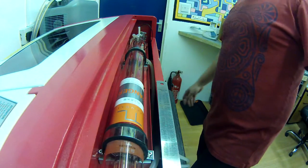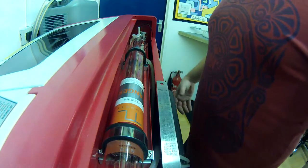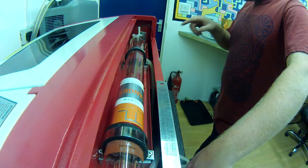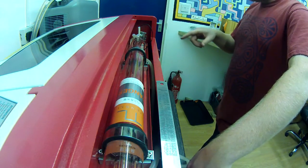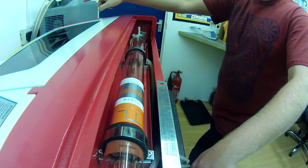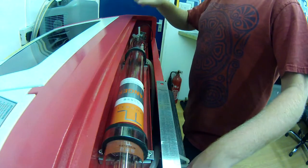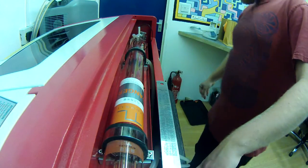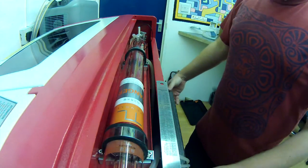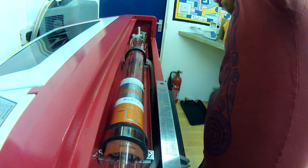I had some problems — I was trying to use my camera as an infrared detector, but I forgot that we're dealing with light that's 10 microns long. So basically what I've done is put a piece of thermal paper on the second optic that this system hits. It comes out of the mirror from the laser, hits the first mirror and goes that way, then hits the second mirror. I've got thermal paper taped over it and I've marked where the outline of the mirror is. So hopefully, if the laser tube is aligned properly — which will be a miracle because it's wobbly as hell — we're in business. I'm going to try and fire this as quickly as possible to make as small a mark as possible.